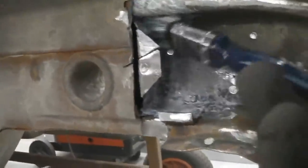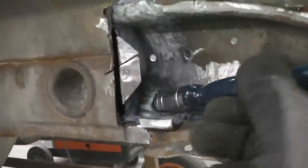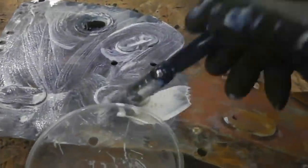I mean, it has been dipped in the acid tank when the car went in, but I still feel that it needs more treatment. It has done a good job, the acid tank, but it can only go so far. And this was particularly rusty, so they did well to get this much off, actually, because all inside them chassis legs are clean. It's just where you get the chassis mount points where it's jammed rust into the crevices. You can't always guarantee they're going to get it all out. It's not going to dissolve a big pile of rust that's jammed and wedged in. And that's what would have happened there on that circular mount point.